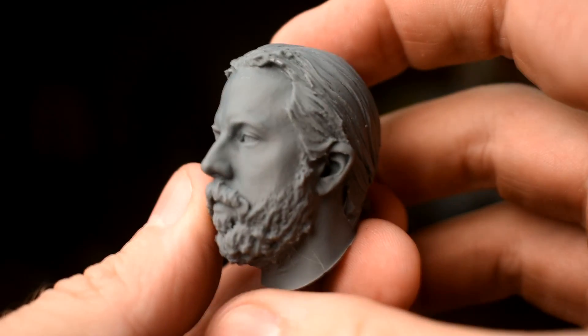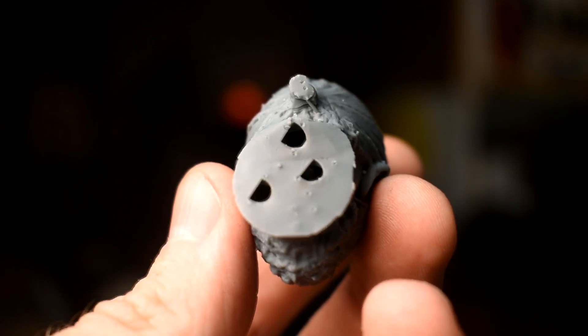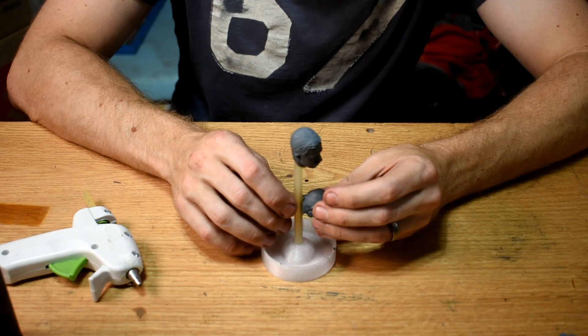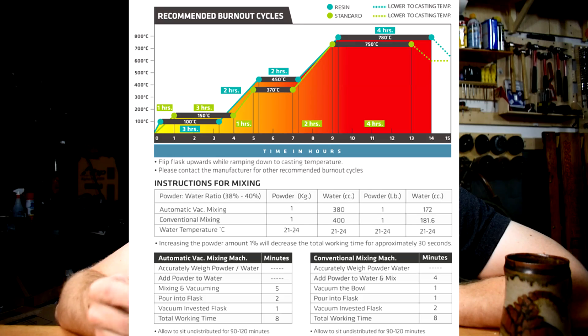So what am I going to cast this time? A print of my head, before I shaved down my beard. This way, if the casting comes out looking hideous, I can say it was all on purpose. The detail is pretty incredible. I printed it hollow with pretty thin walls — the logic being if the resin leaves ash behind and I want less ash, I need less resin in there. I stuck them on a hot glue stick sprue in the same manner as last time, in the same pipe flask, with the same 3D printed cap, with the same exact Prestige Optima plaster, vacuumed the same way, with the same burnout schedule listed on the Prestige website.